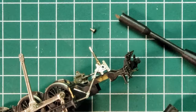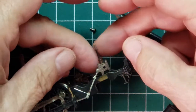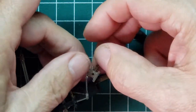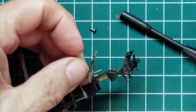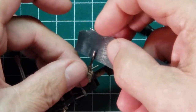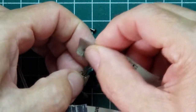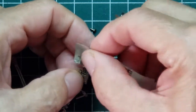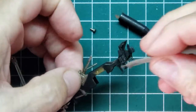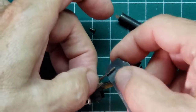So I don't know if this means anything, maybe it does, maybe it doesn't, but this is a piston rod. So typically it would go in and out, in and out. And this would be really, really clean for a couple of reasons. One is that because of the movement, the abrasion of the rod inside of the cylinder would keep it clean. Now, it looks like it's got maybe some paint on it. Could have been part of the issue here.